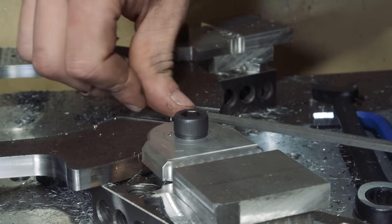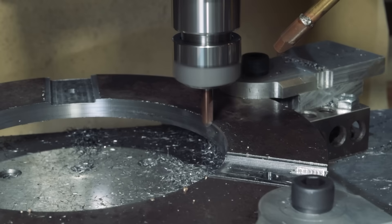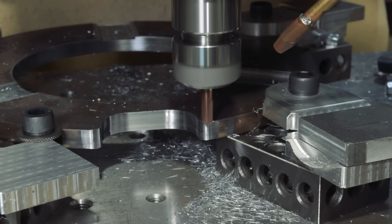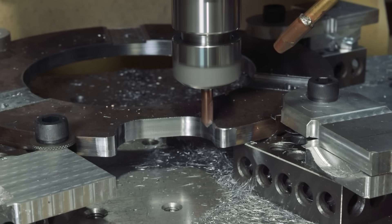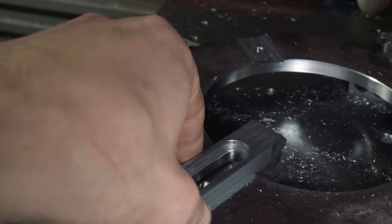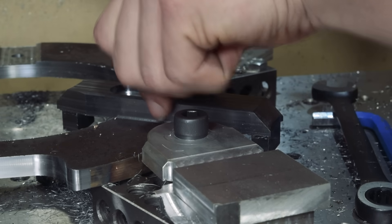I made sure to break at least one end mill, which ended up being a blessing in disguise. I had the height set too low, so had it survived, that cutter would have scrapped this part. I chamfered some edges, tapped some holes and did the obligatory slidey-slidey twisty-twisty. Things were looking good. Now I know this isn't the most exciting project, but even a real engineer will tell you — the big stuff takes time. So if you don't want to miss out, make sure you subscribe. And if you want to get a sneak peek of what's coming up and help speed up the process by supporting the channel on Patreon, who am I to stop you?